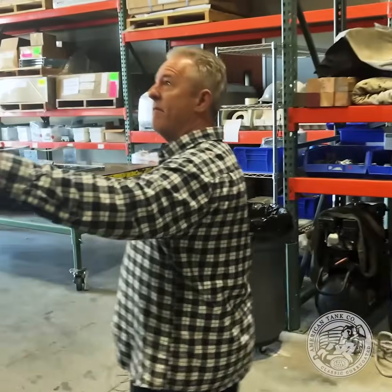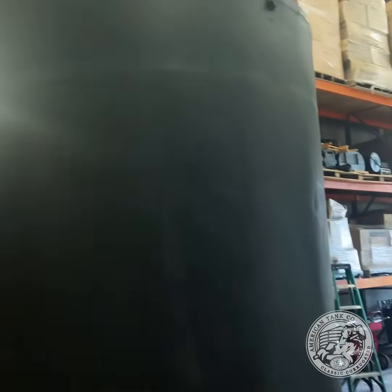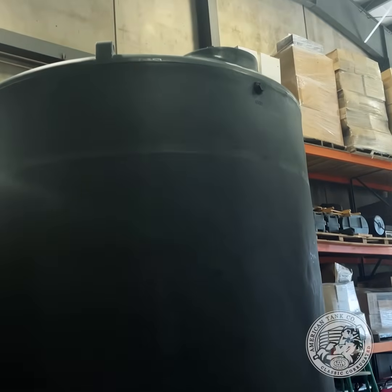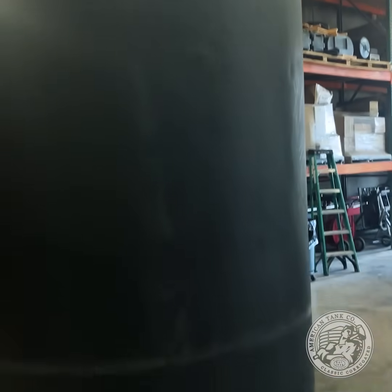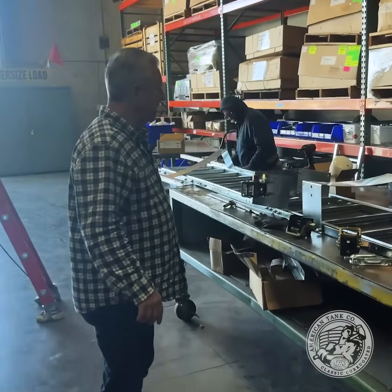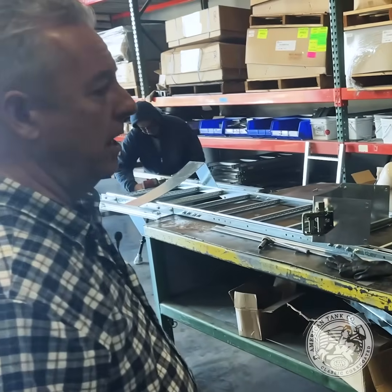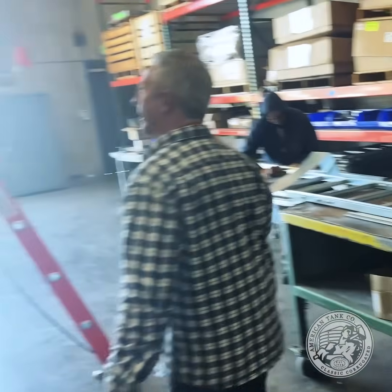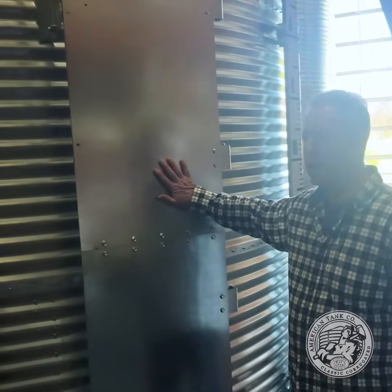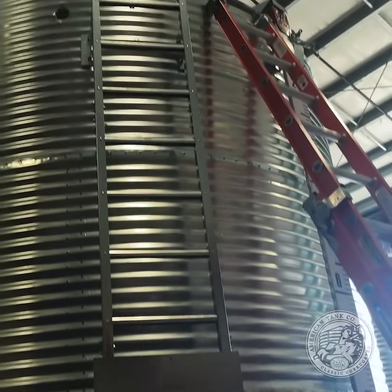We've got a 5,000 gallon tall, we call it. 8.5 foot diameter, sidewall's about 11 foot. And we're building an OSHA cage ladder for that one right here today. So this guy's getting assembled right now. Gonna have a full cage at the top. Locking rung cover is gonna look like this right here. So that guy's gonna have all the accessories on it, and we'll come back in a little while when that thing's installed and trial fitted, and we'll show you what it looks like.